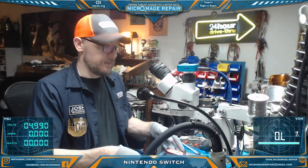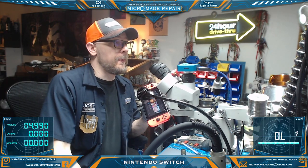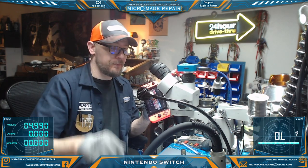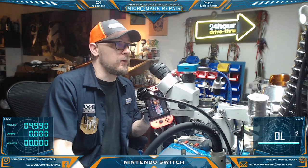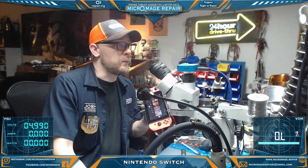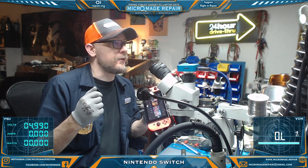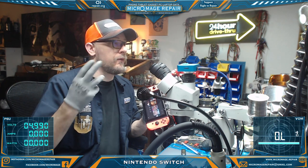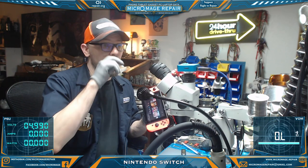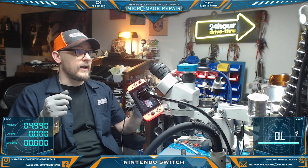Okay, in summary on this guy, we had extensive liquid damage. It actually didn't look like much to begin with. Well, we started out, we tested it, we were drawing 0.00 amps. So we opened it up, began to look around, we found some minor liquid damage around M92 T36. We found some more severe liquid damage around BQ24193. We had to replace a cap that had shorted out. That actually turned out to be the only problem in that area. We kind of got lucky.